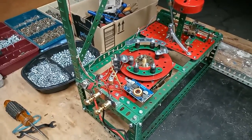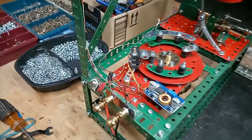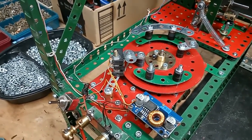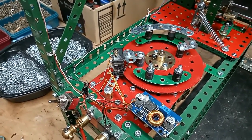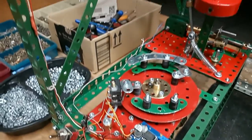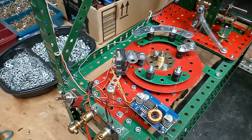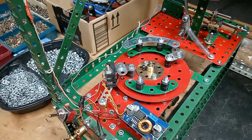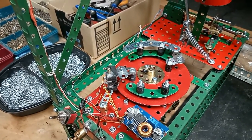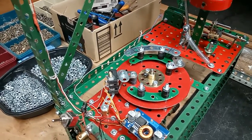The model is controlled by this rotary contactor. There are three micro switches. The bottom one runs the main motor for the cars. The middle one runs the bell, and the top one operates a reversing relay so that for each operation of the main motor it runs in the opposite direction, so that the cars can go up and then down.